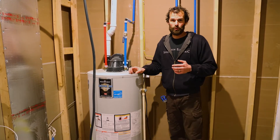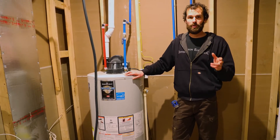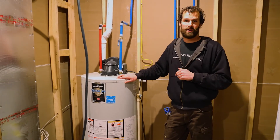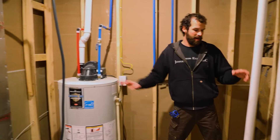If this were an electric water heater, almost all water heaters in America are the same — a two-pole 30-amp feed with 10-gauge wire to service an all-electric water heater.